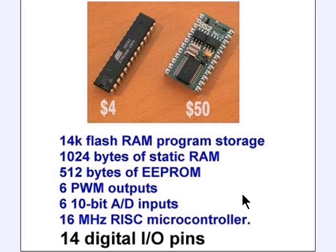You really won't be dealing with those 32 commands because you're going to use what is called a compiler on your PC to write the programs. It will be using a type of C, so you don't have to deal with the torture of having to deal with assembly language. Most important is Arduino has 14 independently programmable digital I/O pins.